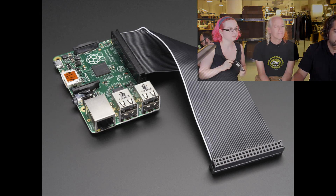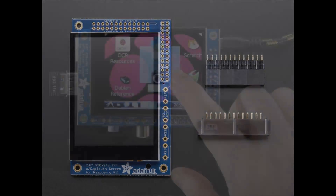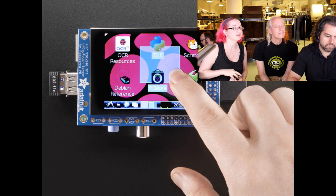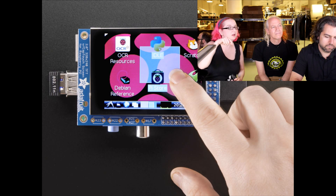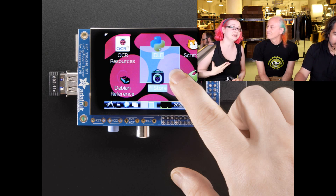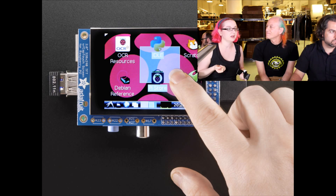Speaking of Raspberry Pi stuff, this is a big deal — this is the first and only Raspberry Pi capacitive touch screen. It's basically the Pi TFT, but we got a custom screen made which has a capacitive touch controller. The TFT itself is the same — 320x240, sits on top of the Pi, uses SPI to communicate. You can run X11, PyGame, SDL. We have Cupcade stuff for emulators. Instead of a resistive touch screen where you use your fingernail or a stylus, you use the pad of your finger, just like modern smartphones. People begged us for capacitive touch for a very long time.